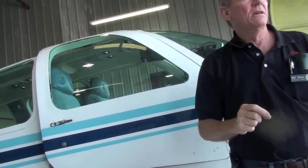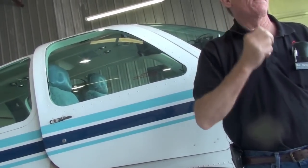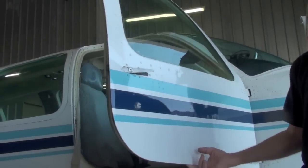Okay. If you'll just go around the airplane. You're talking about the LPS-3. LPS-3 is once a year, and that's corrosion preventative only. LPS-2, once a month, looks great. It's cheaper to wipe off a little oil on the flight control than it is to replace parts. Okay. LPS-1 we'll talk about when we get there.